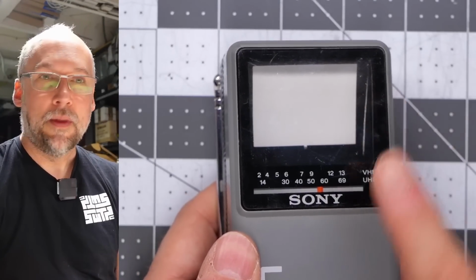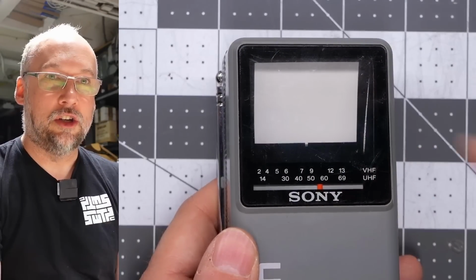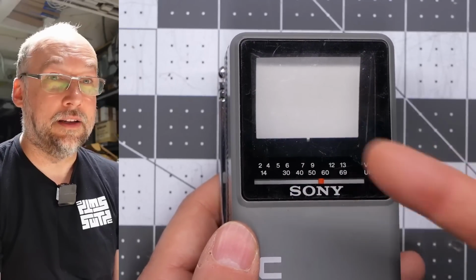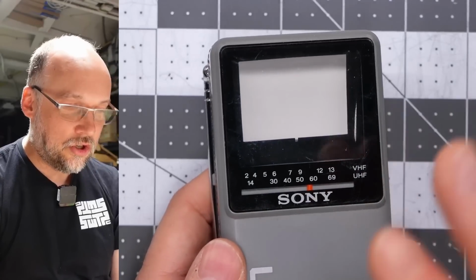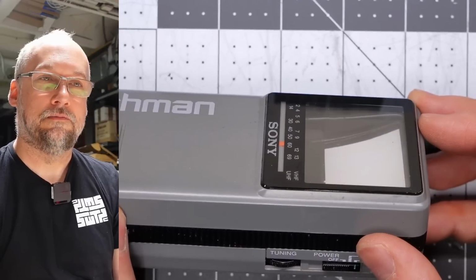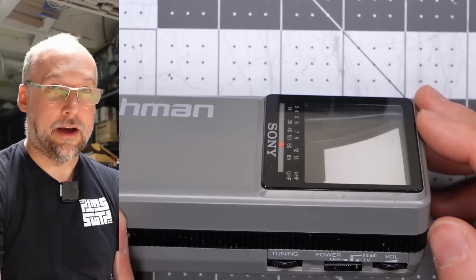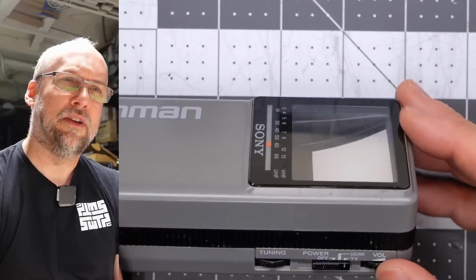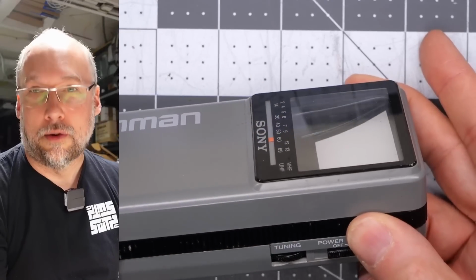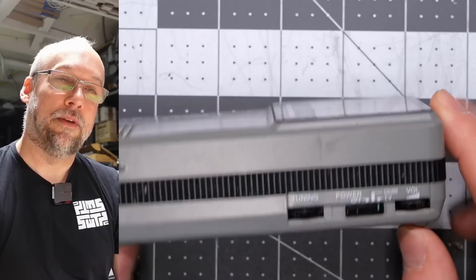That's the phosphor coating, and the electrons shoot up from the bottom here, hit the phosphor there, and it lights up, and you're actually looking through the electrons. The electrons are scanning between your eyes and that phosphor, so that's kind of cool. They sort of turned the CRT idea inside out. I don't know if Sony invented this style of little glass picture tube or what. In the end, lots of companies ended up making stuff like this. Well, not lots, but there were like door phones and things like that. I've had some videos on the channel before about it, but it is pretty neat how the electrons come up and you look right through them. Of course, electrons don't look like anything to our eyes. We don't see them. So all it does is light up the phosphor.